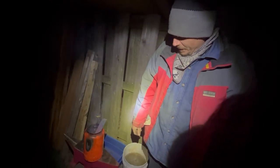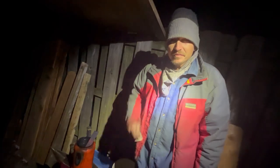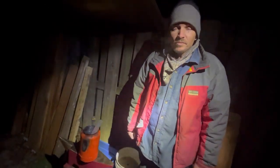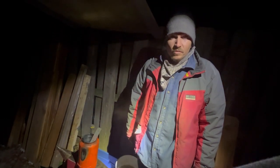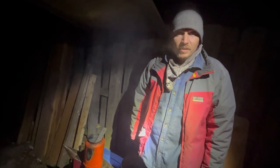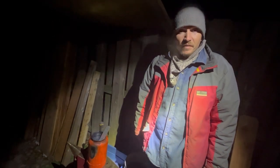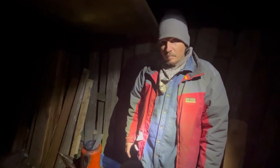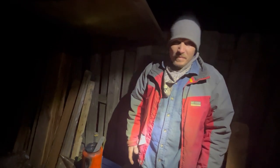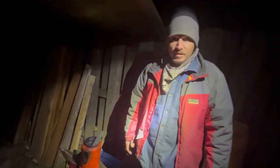So we'll let that hang in there and cool for a little bit, and then the objective for tomorrow, once we get this thing tempered in the oven, probably tonight, we're going to clean up the bevels and get those finished up and looking pretty decent, and then we're going to pick out some handle material and try to maybe prep that and get that ready. And once we have the bevels and the handle material prepped and ready, we'll probably try to glue them up by tomorrow. Maybe start working on some of the finer stuff. But really, Sunday will be the day where we're gonna try to hand sand everything down to the final finish.